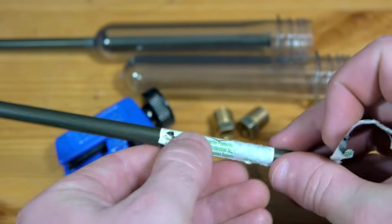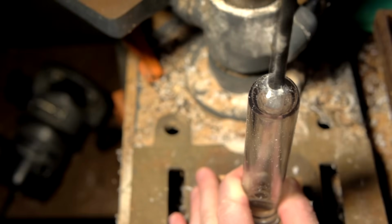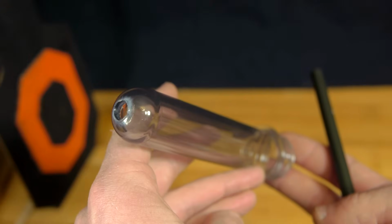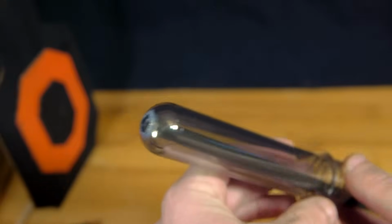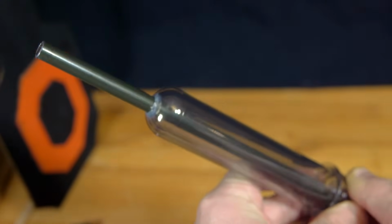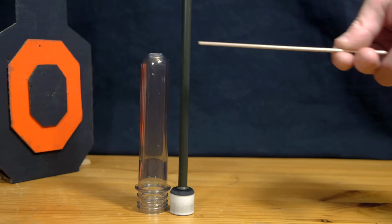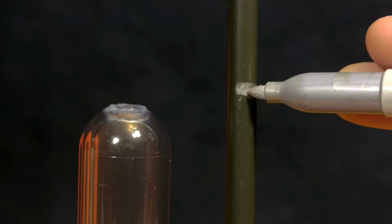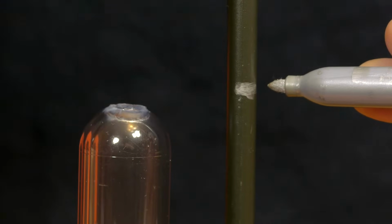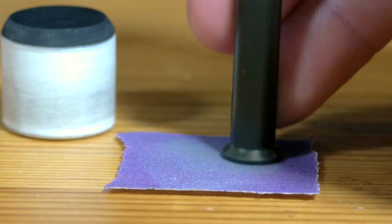The line will extend through the front of the preform, so my next task is to drill a hole of the same size or slightly larger than the line's diameter. Cementing the barrel in place is a bit of a tricky process, and the first step is to determine where on the line epoxy will need to be applied. The end that still has a flare is set on the piston next to the preform so that I can mark about where the line will be coming through. Before I continue any further, it's a good idea to smooth the flared end of the barrel with some sandpaper.